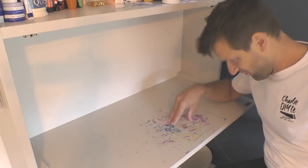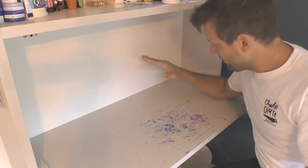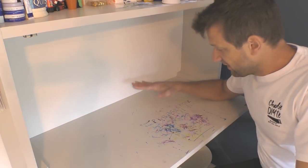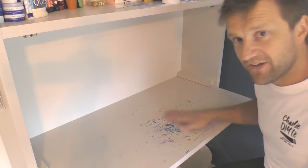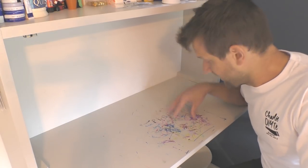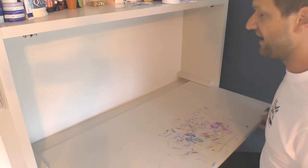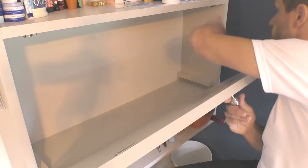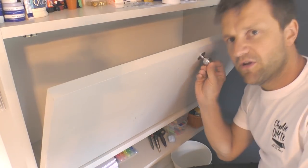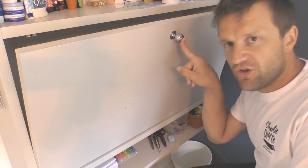If your painting would work, my firm advice to you is: even with the best toughest eggshell paint, when you've put your final top coat on, you want to put a couple of coats of varnish or lacquer on top of that. This would have made this much easier to clean, but all it needs is a couple of coats of paint and that will be resolved. So there you go, my folding desk — which is kept up with two magnets in the corners, rather like you would have seen if you looked at my last video on what hinges to use on wardrobe doors.